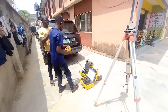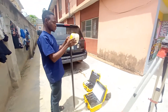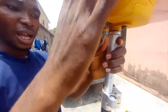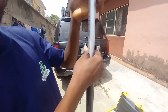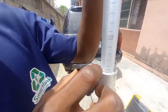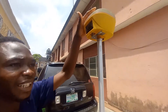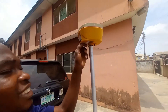This is our rover. What you do is fix your rover to the pole, and then set it to a certain height that you want to use for measurement. When you are doing a topographic job, you have to take note of the height you're working with. The height I'm setting it on is 1.70 — you can see it's on 1.70. After you set the GPS on the pole, the next thing is to fix the antenna of the rover.